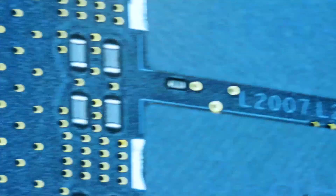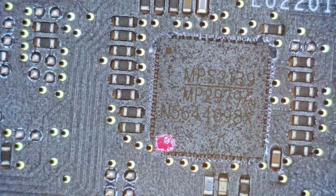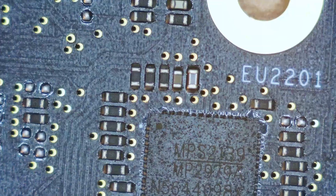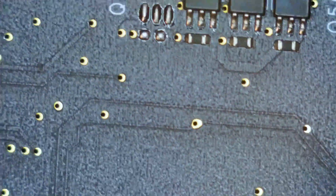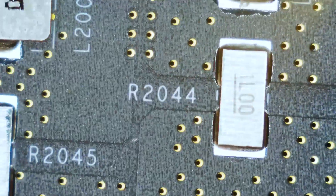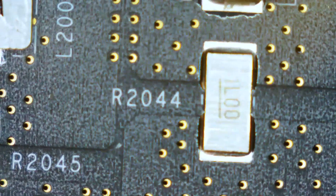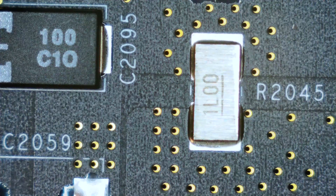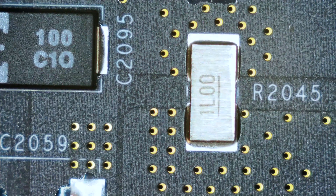What I'll do now is take a closer look around the board under the microscope. The voltage controller right here unfortunately does not have a public datasheet. That said, as far as I'm concerned it does support I2C, so you could just get voltage control. These are resistors which I reckon are just shunt resistors — which is absolutely something I'm going to try: shunt modding this thing to see how it reacts.